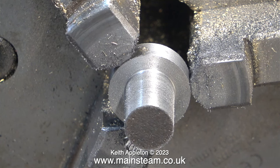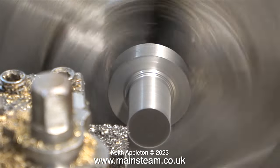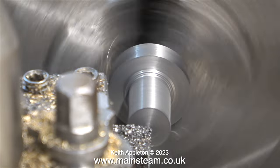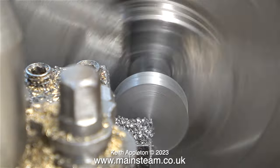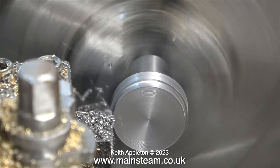I'd already had the part in the chuck the other way round and turned a larger diameter, which is now suitable for being held in the chuck. I don't want this to be a press fit — I want it to be an easy fit so I can use Loctite 603. By easy fit I mean not tight, but not a rattle fit either. Anticipating someone removing these bearings in the future, all they'll have to do is heat up the cast iron blocks that support the bushes and no violence will be required. Cast iron is very strong, but not if you hit it with a hammer.